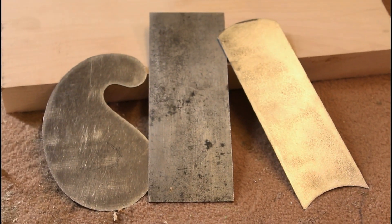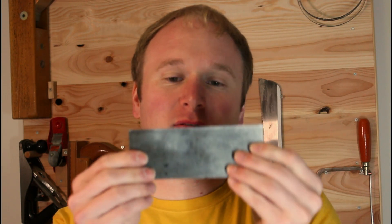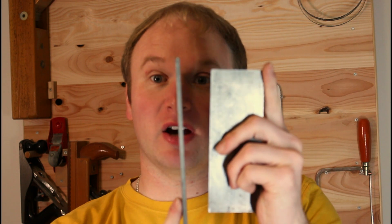Quite often the first time you sharpen it you won't be sharp — you'll just be making dust. Don't worry about it: polish the edge again and try again, keep going until you eventually get that shaving. Card scrapers are probably the most underrated tools and they're not used very often because they're not that easy to sharpen. Also note that if your edge isn't perfectly flat, you can use a file to make it flat. I hope this video has helped — let me know how you get on in the comments. Thanks for watching!